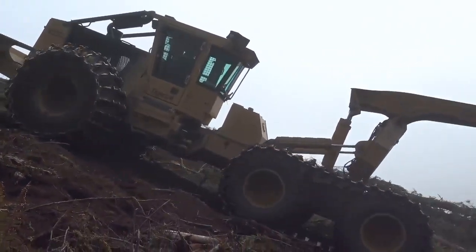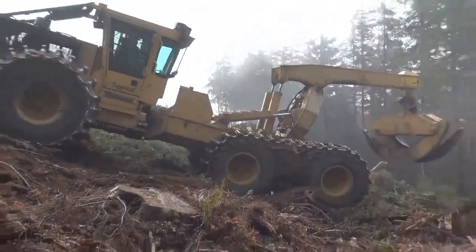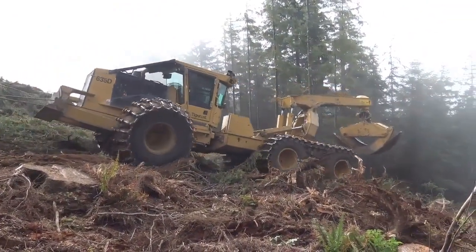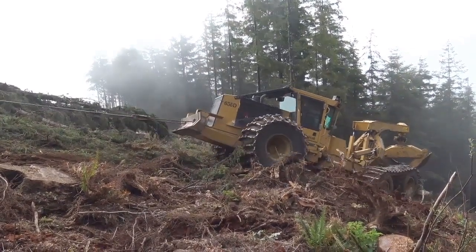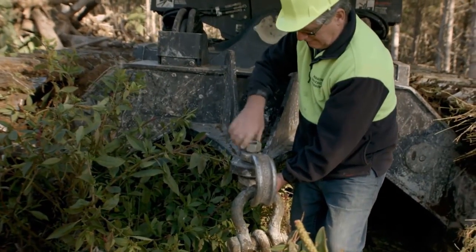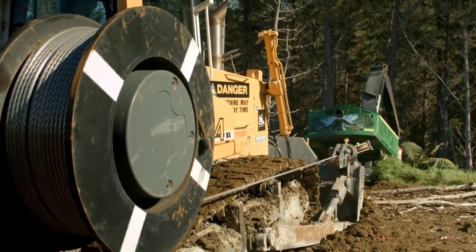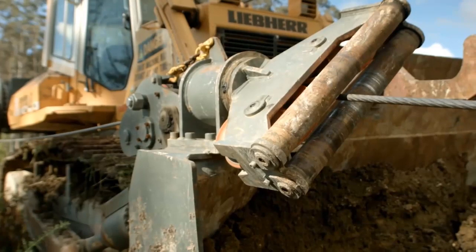This constant tension control system keeps the steep slope machine, SSM, secure on the slope and maintains operator selected tension at all times. The constant tension system speed matches with the SSM machine also. In short, the SSM machine operator simply places the system in auto mode and the traction line does the rest. This allows the operator to focus on cutting and pulling trees. All winch functions are controlled from the right-hand joystick, so the operator's hands can stay on the joysticks for better comfort and productivity.